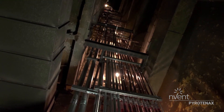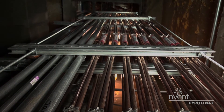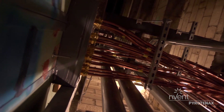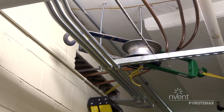One of the most challenging parts of going vertical in this building was the leasing aspect — we only had a certain amount of space we were allowed to use. Just think about the savings in space alone, vertically in the shaft. If you saw the location, with conduit and wire there was no way this job could ever have been done without the use of MI.